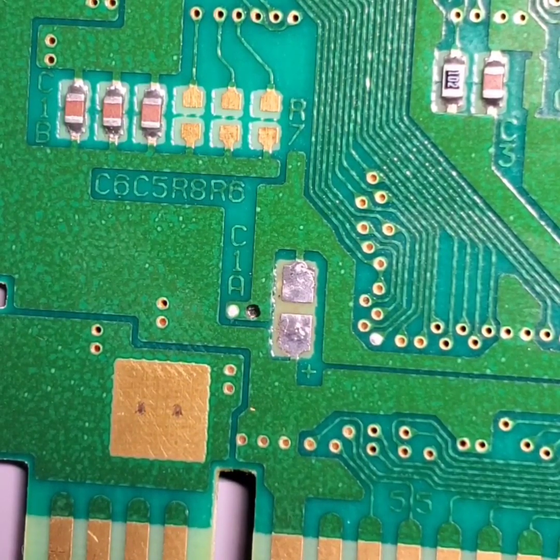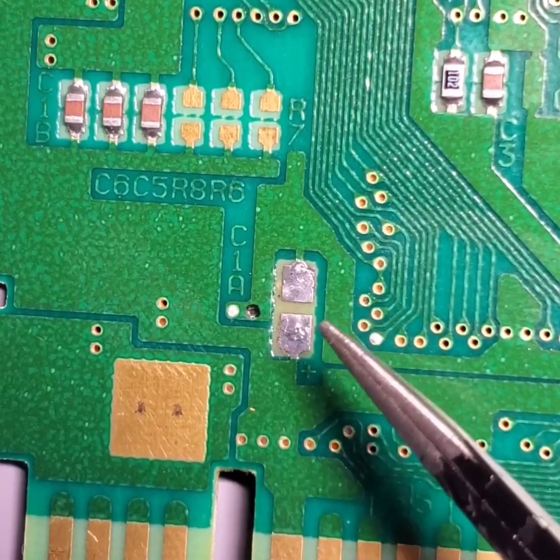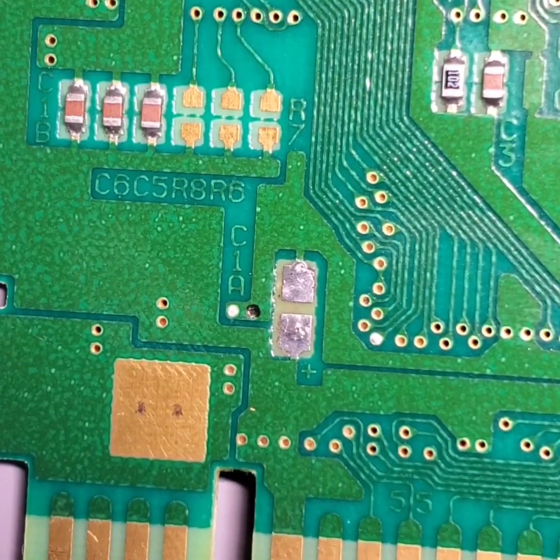And so after time goes on, the electrolytic fluid can continue to eat away at that existing solder around it and eat all the way down to the trace of the main board and possibly eat away all the copper of the trace itself. So in order to prevent that from happening, we're going to remove all of the solder off the board. We're going to wick it all away. We're going to try and give it a real good scrubbing.